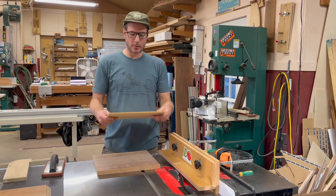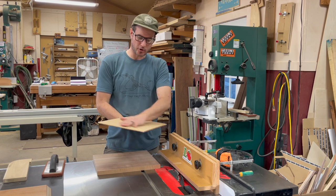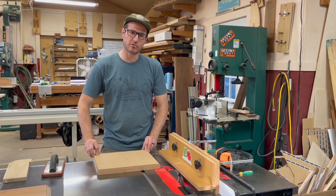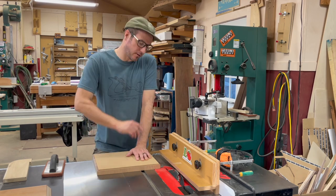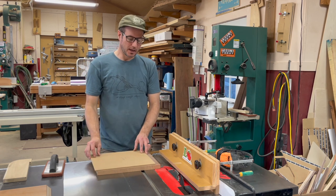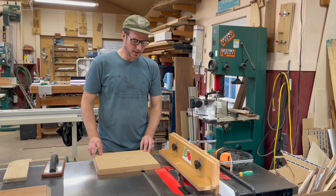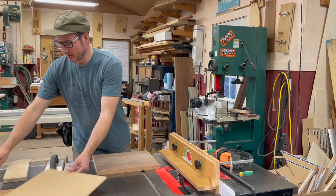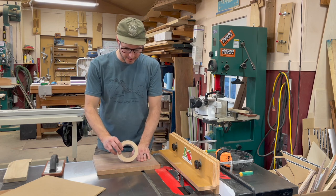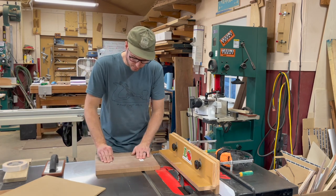When I did production runs of this, I would have the templates hanging on the wall. I would put 100-grit sandpaper on here, drop it down, line it up to the edge, make sure it's running nice and parallel, hold down on that sucker and then cut it. The issue with that is if it moves you get into trouble. I've done a lot of these boxes and probably once or twice I've had an issue, so for this I'm going to use double stick tape. I really like this stuff — it's Spec tape, pressure-sensitive tape. Don't put too much because you will damage your veneer.